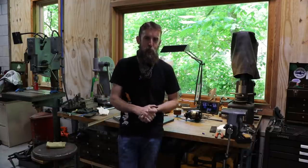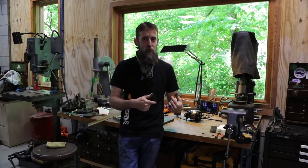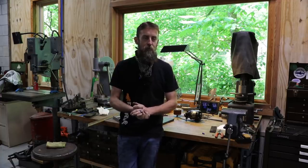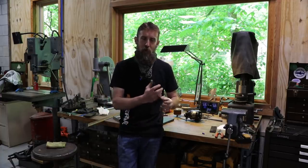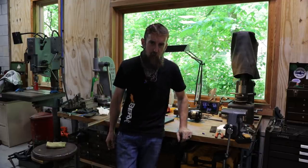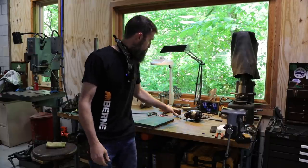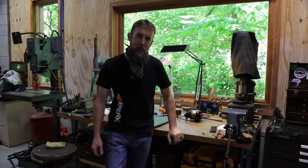Some of you guys may want to build one yourself because they're handy. If you use carbide in the shop at all, one of these could be useful to you. More commonly used with sharpening hand scrapers for machinery building, but for sharpening carbide in general, a slow speed lap is the way to go. And what I've got here hopefully will make a decent unit.